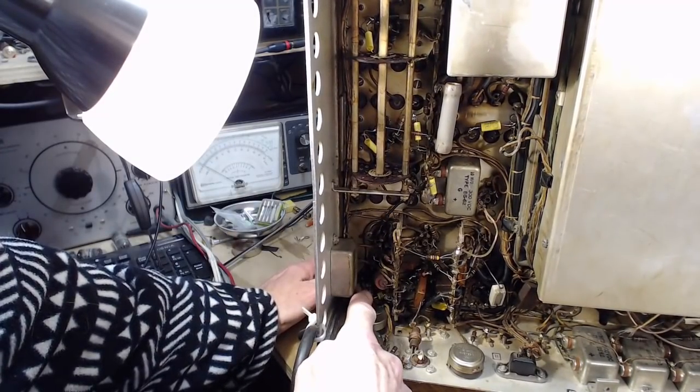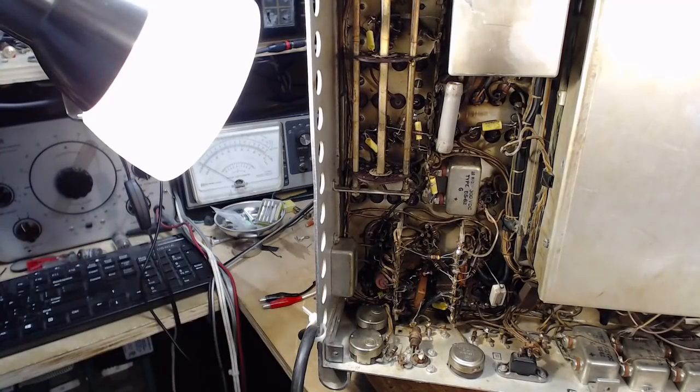So you want to get a look right in here. So I'm going to switch to the close-up camera. Where is it? There it is. Switch over to the close-up camera and we'll tuck it in there and see what we can see. Solder joint of the capacitor doesn't look very good to the wire it's soldered to. Looks like the solder didn't really flow, but another one up in there doesn't look terribly good.